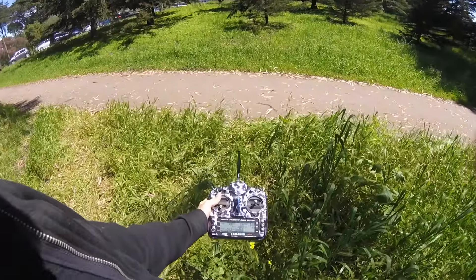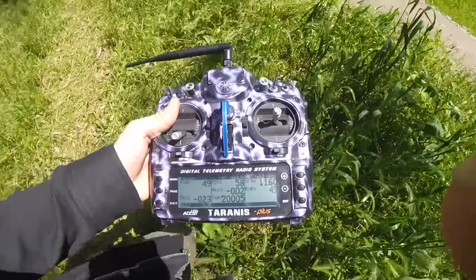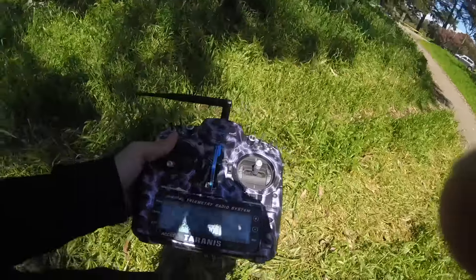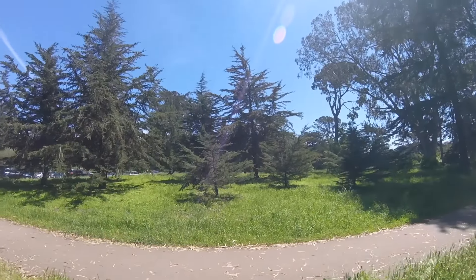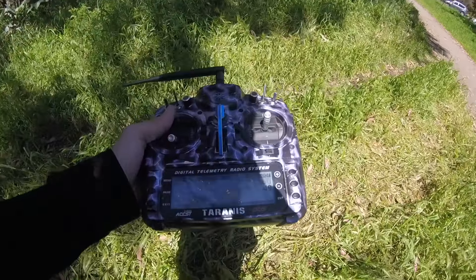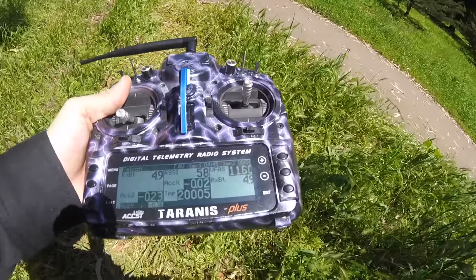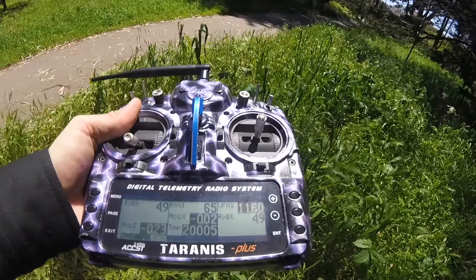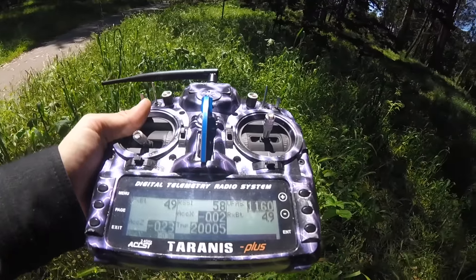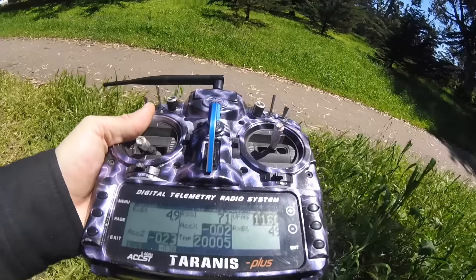First thing I want to do is turn my antenna sideways. You can see I'm sitting somewhere around 65. I start far to the left of where I think it is — I think it's probably right around there — and I'm sitting at 55 or 56. I'm going to do a slow rotation to the right and just watch as my RSSI goes down, goes up. So it jumped to 70 and then it went back down. Do you see that? Right around there.